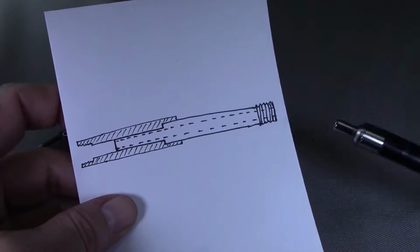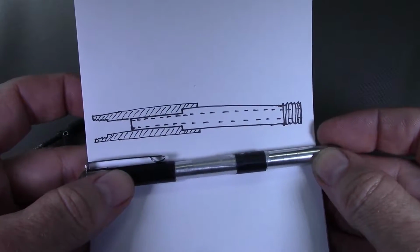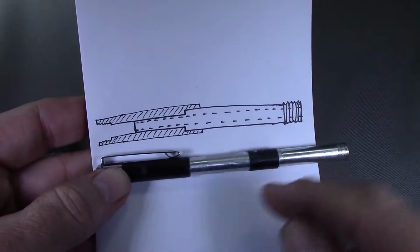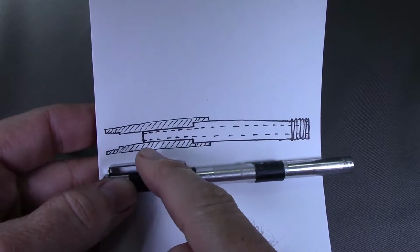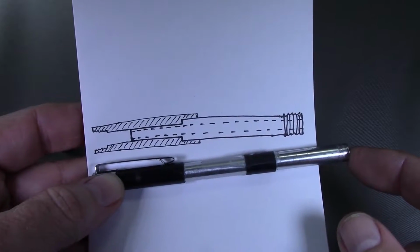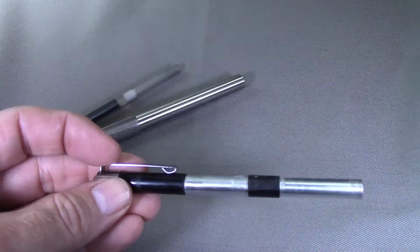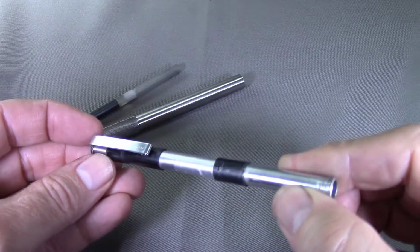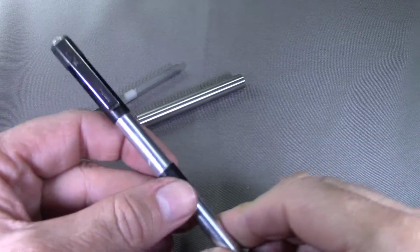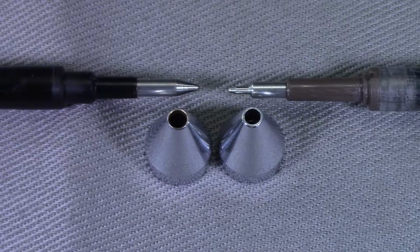I've tried to illustrate what I did in this drawing. The plastic core gets cut 40 millimeters from the button end. About 3/8 of an inch of its end gets enlarged to fit the 5/16 aluminum tube, and the aluminum tube gets reduced in diameter to fit into the bore of the core. While best done on a lathe, the aluminum tube can be reduced by using a flat file. Some ink cartridge tips will require enlarging the opening of the tip hole.